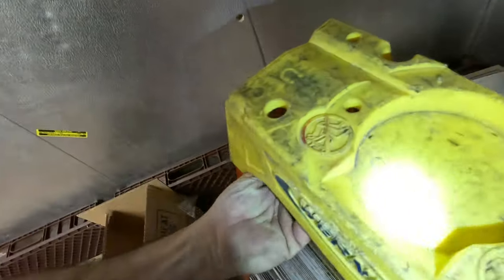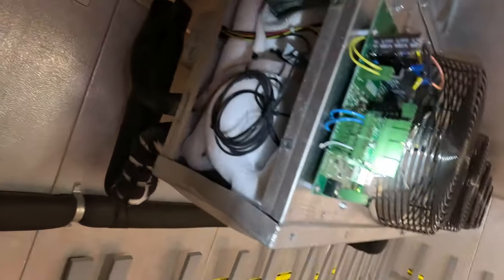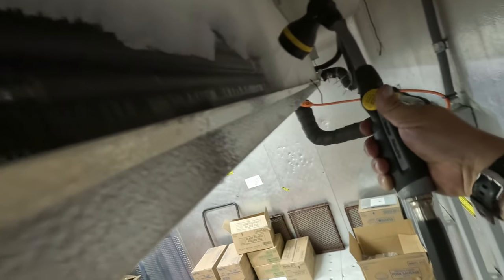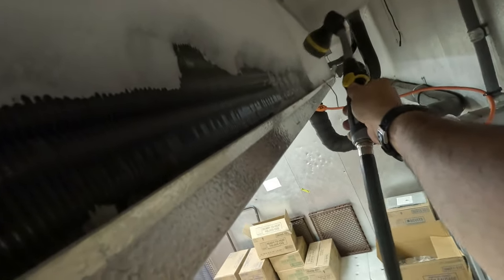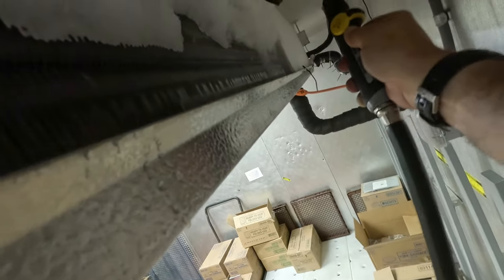I had another compressor to change this morning — I don't see that happening right away. That suction line and liquid line are insulated and the hot gas line coming down should be melting. We could have all kinds of potential issues and it's really hard to tell what's going on. When using the hose, melt the bottom first because otherwise it can run over the edge. Stay away from the sensors — you want to stay in defrost as long as possible — and watch your water flow because that drain will overflow easily. It's frosty, not solid ice, which is good.